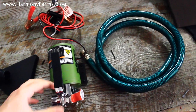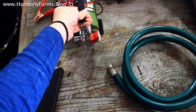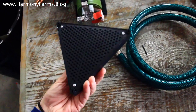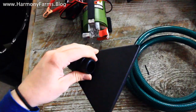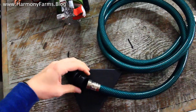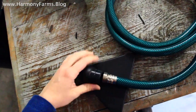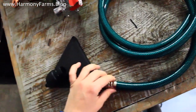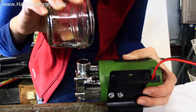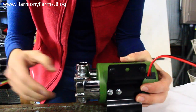Opening this pump, there is obviously the main pump body, which you need to do a couple of things to first. I didn't initially understand what this was, but this actually goes into the pond — it's a filter. Your intake hose's threaded end goes into this little slot here, and then it goes into the pond or whatever your intake area is to keep it from getting debris. You've got to pour some oil inside that little hole right here that has a sticker over it, and then you've got to fill it with water.